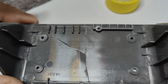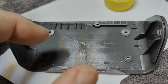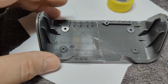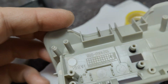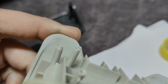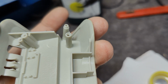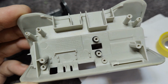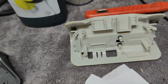It bonded more or less instantly. Just pressed it together and then massaged it a little bit. And now let's wait until tomorrow and perform a little strength test. The fun thing when I tried to repair these little thingies here, see? I didn't put one of them completely straight. I was a little bit sloppy. But I think, just to show an example of how you can repair ABS using acetone, this is okay for that demonstration.